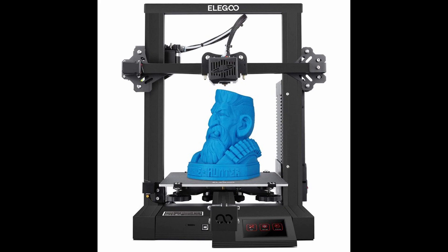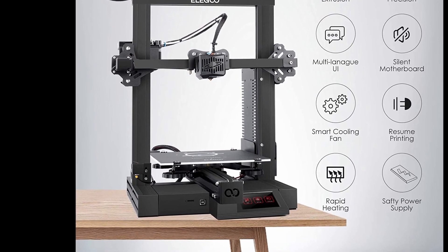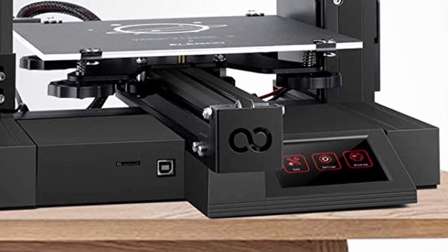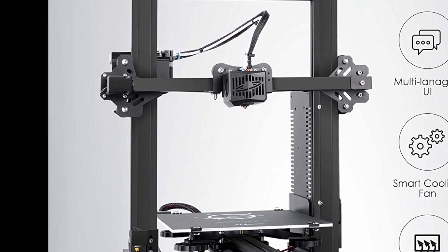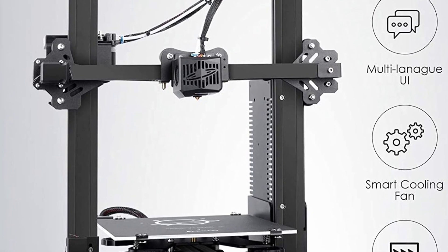Let's start with the exterior. Looking at this 3D printer from Elegoo, it's an i3-style 3D printer. The base is H-shaped, made out of 3030 aluminum extrusions, with on the left side a box where the controller board is housed, and on the right side an LCD color touchscreen. The Z-frame is made out of two smooth 2040 and one 2020 aluminum extrusion. On the back side we find a 350-watt power supply unit, and because of its placement on the back of the Z-axis frame, there is only one Z-axis lead screw mounted on the opposite side.